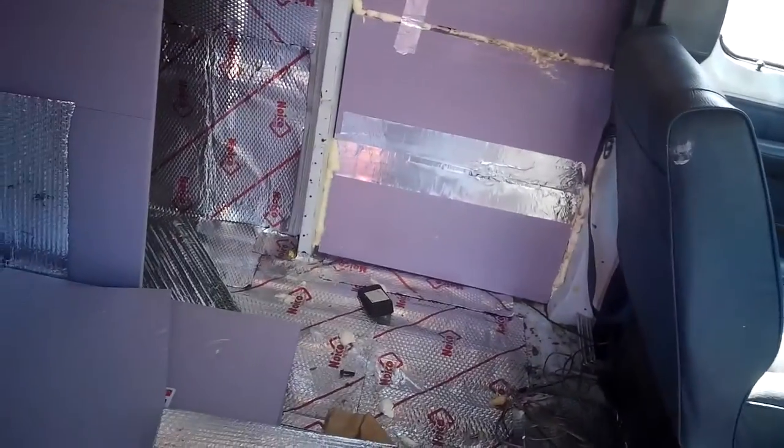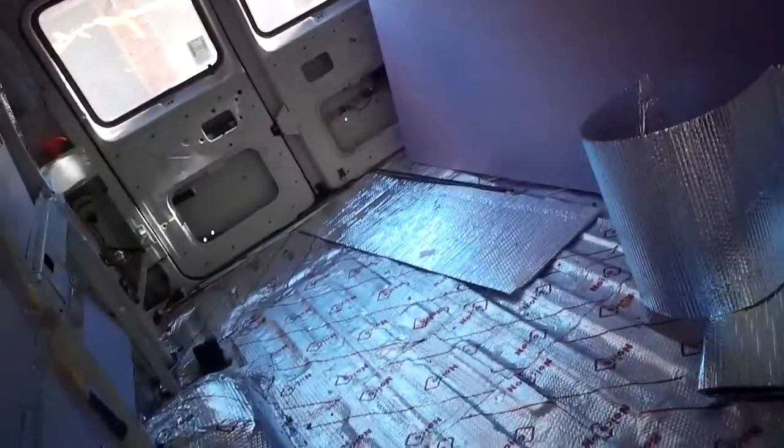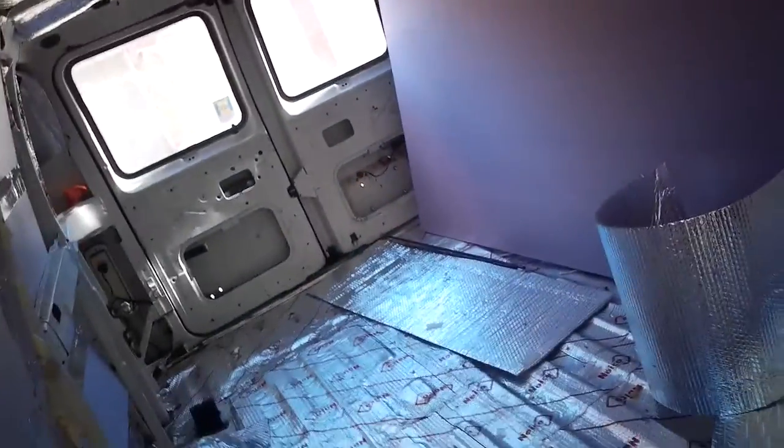They call it spray insulation and I'm using it basically like mortar between bricks — that's how I'm working here. It's not going too badly; you can see the wall right in front of me, not perfect but not bad. When you're using small cuts of foam board insulation, you can't really make stencils, so you basically find the space where it'll fit, cut it so it fits, and then foam it in. That's basically what I've done here.